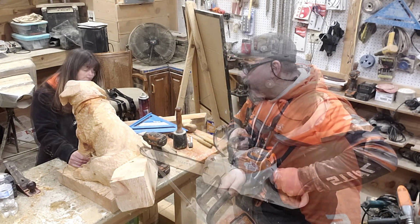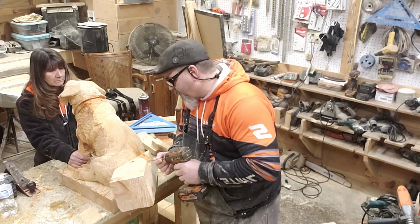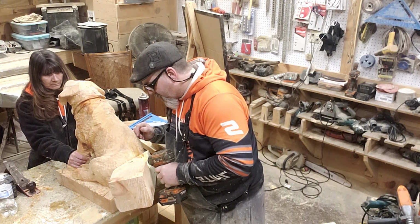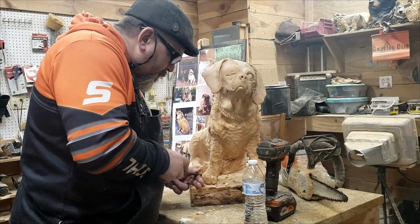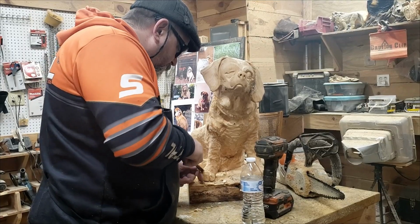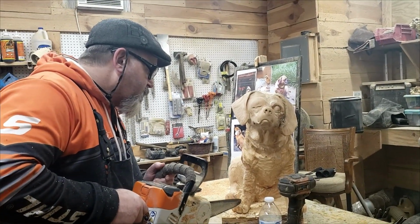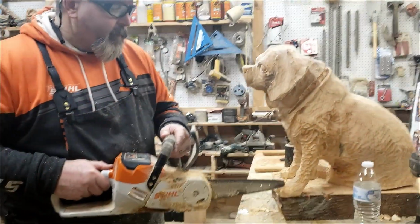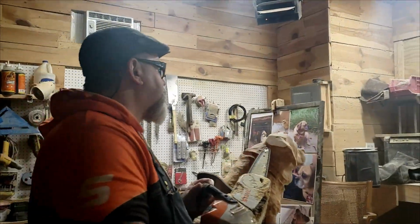Also, here I'm not carving the tail right now, technically. All I'm doing is creating a notch so that I can get the right angle, and I need to make the beam that I'm drilling into or screwing into the skinny wood. So you always go skinny wood into fat wood. In other words, you want to be drilling and screwing into the thin wood to tap into the heavier section, if that makes sense. Yeah, so there, I said it.